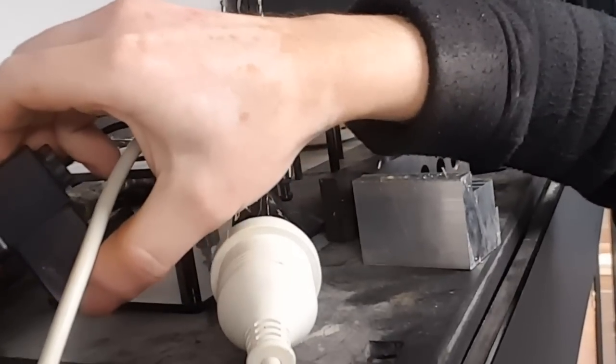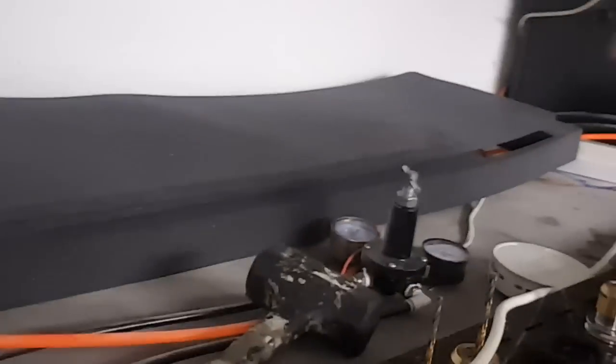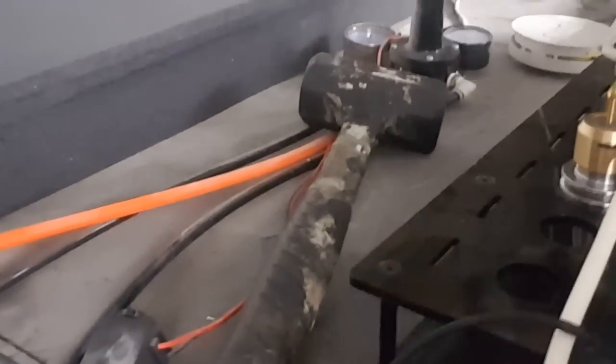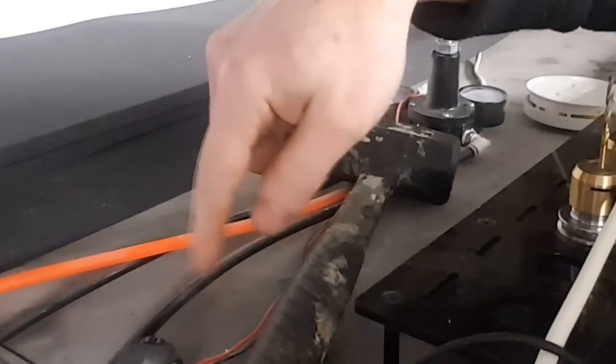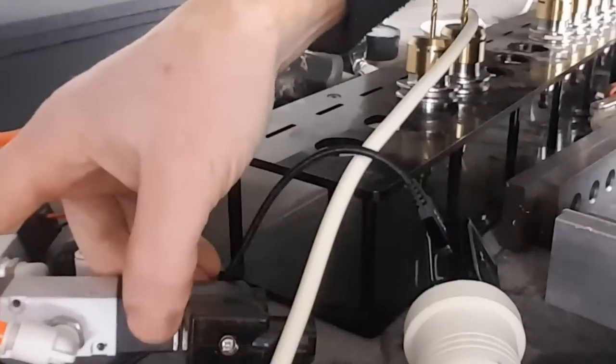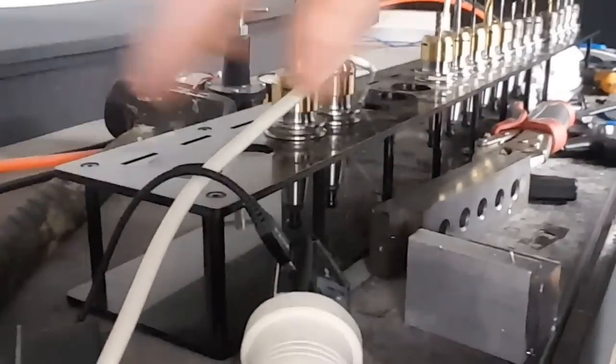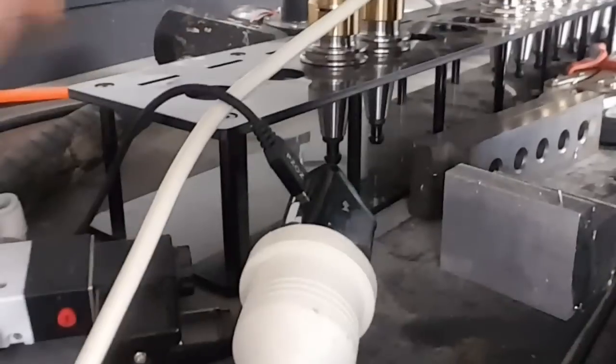With the tool changing, I'm using a solenoid valve. One solenoid valve is for the air which goes to the spindle and turns on automatically when you turn on the spindle. The other one is for the tool changer — I just press a button and I'm changing the tool. I thought it could be nice to have a button in front of the CNC, but it's really not worth overcomplicating and I don't find it annoying.